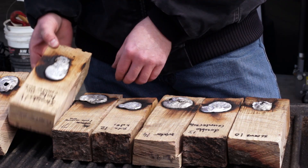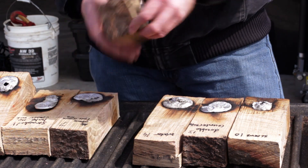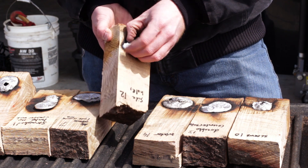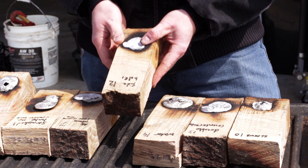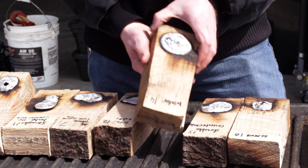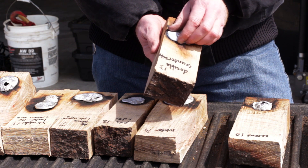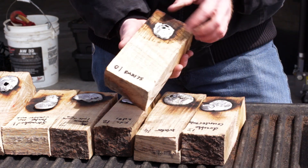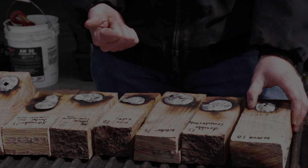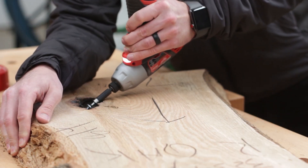The geometry test holes did yield much more useful information, and I've arranged them from left to right in ascending order, the right being the most secure. Starting on the left, it was a through hole with no countersink, then you have a single countersink, then side holes, then the one that I poured water on at the end. Next up, you've got double countersinks — that's where you've got countersinks on both sides of the workpiece. And then finally the screws. The screw one — I could not even perceive any motion in that cast piece. In Johnny's video, he gave his perspective on how screws impact the cast insert.